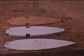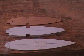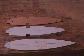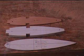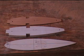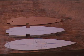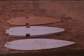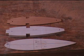The first step is to make the section shape, which is the bottom foil you see in the picture. The middle one is the pattern derived from that first shape, with the 1/8-inch plywood skin thickness deducted from its sides. The top is the actual rib I use, made using that pattern and cut with just a router. By far the majority of the work is this process, but now that I've got the patterns I can duplicate them over and over again with no problem.